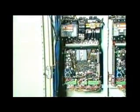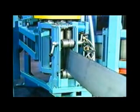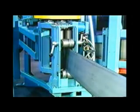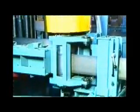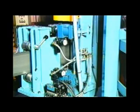There are two modern digital DC drives on the Superloop. The first drive controls the entry pinch rolls, which are manufactured from SAE 6150 case-hardened steel and match ground as a set. Both rolls are driven through a square gear arrangement, which maintains gear contact for varying strip thickness. The pinch roll closure is accomplished through two large diameter pneumatic cylinders, each independently adjustable with pressure reducers.